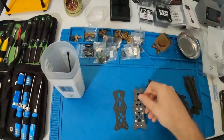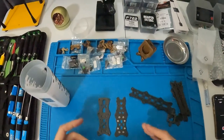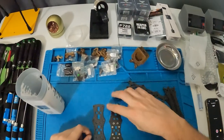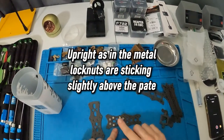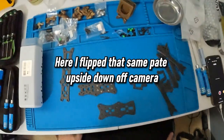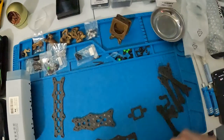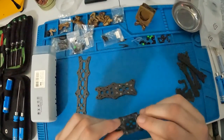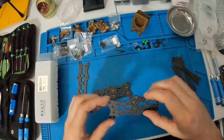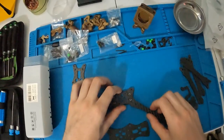This frame is the Siren F5 mini split, which means there's two bottom plates. The regular F5 mini non-split would just be one bottom plate. With getting started, this top piece is what your ESC is going to mount to, and this is what goes on the bottom. You're going to take your little key fob — make sure the countersunk screws are facing upwards. It's different on one side. That goes on top, and this is your bottom plate with countersunk screws on the bottom.